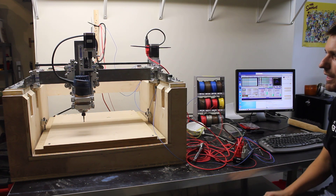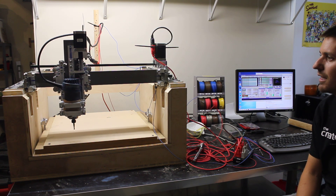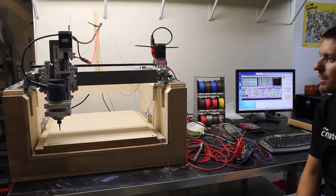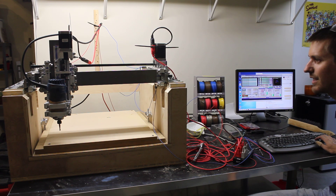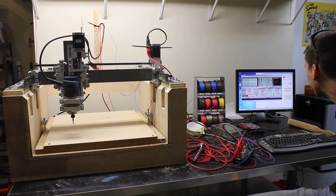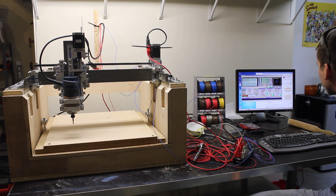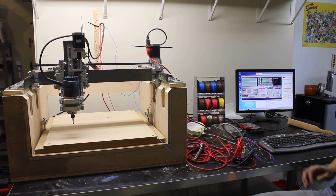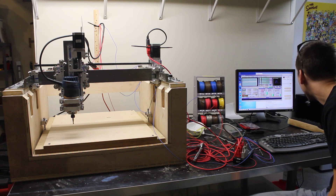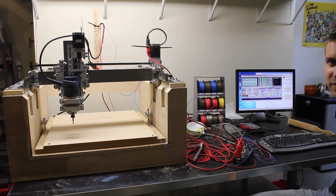If I hit this button, it goes back to these special home switches. So it's home. Now I'm going to set its place to start — I'll say that's where it's going to start this program. I'm going to reset everything to zero and regenerate my toolpath, and as soon as I run this it'll start writing this program.